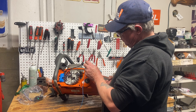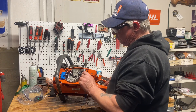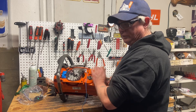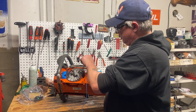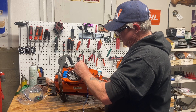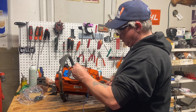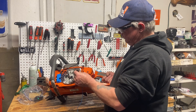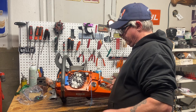The forced air goes up into your air filter system and keeps it clean. This is what I was telling you in the last video — how sawdust packs on it and goes right into the filter on a Stihl, whereas a Husky doesn't as much, because the good air comes around from the fins of the flywheel and goes a certain distance into this tube, giving you that forced air up into the carburetor. All the debris and junk passes out of this area and out from the saw.